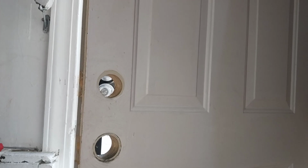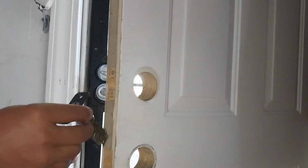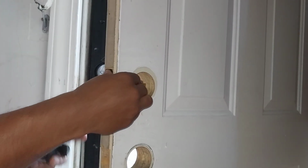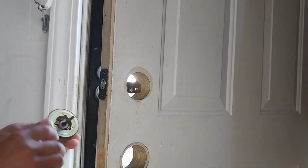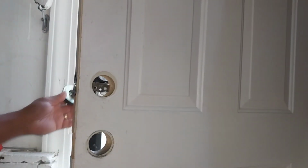It depends on you and what you like. This is a basic set that comes with all the bells and whistles. Break it out. It might have been good for the video if we had broken it out ahead of time, but we shall see. As you can see, everything comes pre-assembled. We take our latch, put it in now. Oh yeah, fits pretty good. What I like to do is dry fit everything. If you're not familiar with that term, it means you make sure everything fits before you put your screws in.